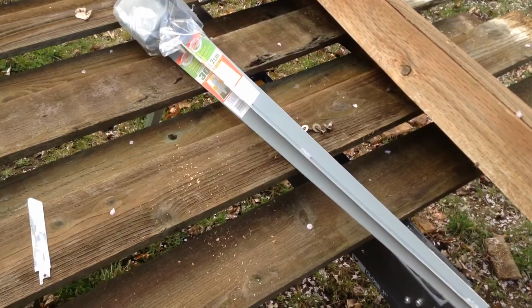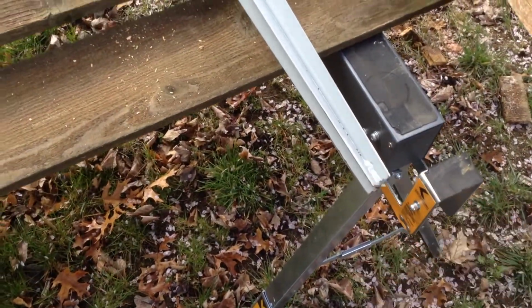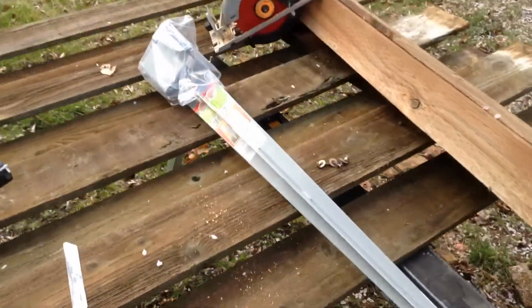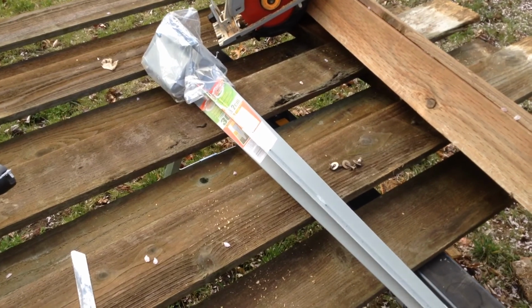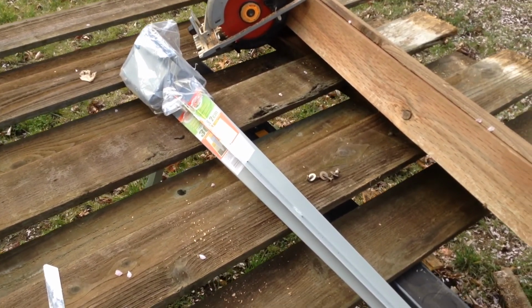I would have almost rather used the short one. One of the things that'll make these better is to get a grinder and sharpen the bottom of these, and they're going to pound in a lot better, because what these do is they pound and they split in. They pound right into the old rotten post, and they actually use that for stability. The advantage of these in windy areas is that when everything's put together, the fence ends up a little springy. If the wind hits it and bends over, it springs right back. It's not something like, well, it bends and then snaps and you're done.